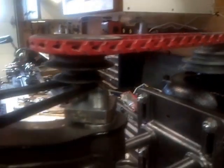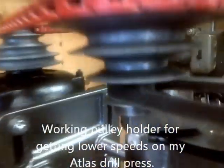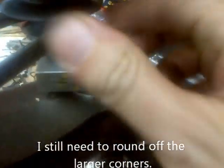So here's the drill press speed reducer — well, it can also be a speed increaser, but right now I've got it set for lowest speed. There's the block, I trimmed it down a little bit. I haven't put the handle on it yet — there's going to be a handle coming out here so you can lock this down. Inside the column there's a cam lock that works off this. If you look at the posts you'll see everything. Let's turn it on.